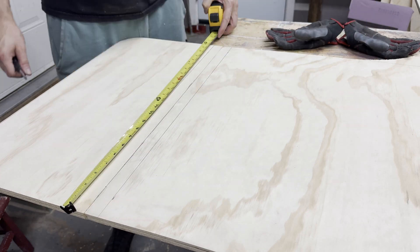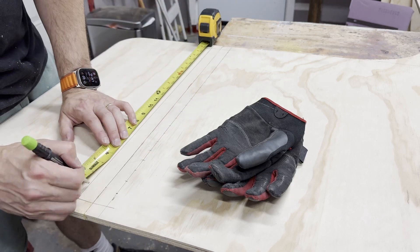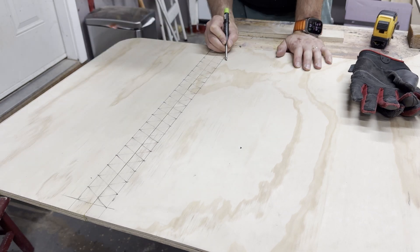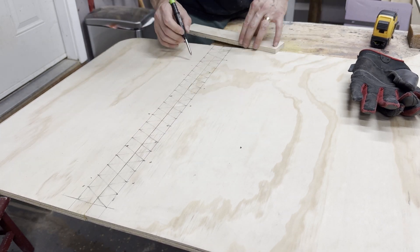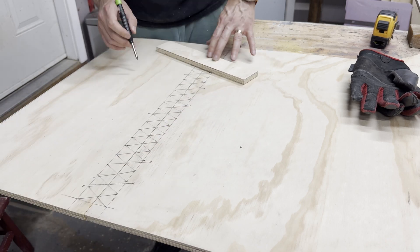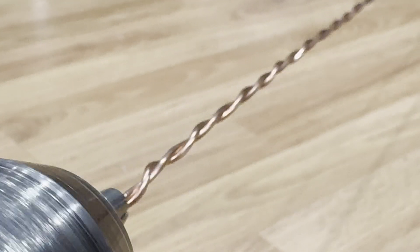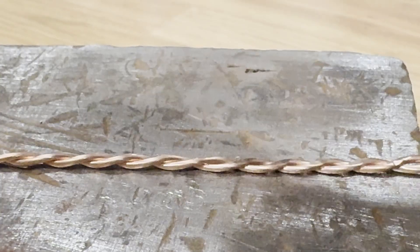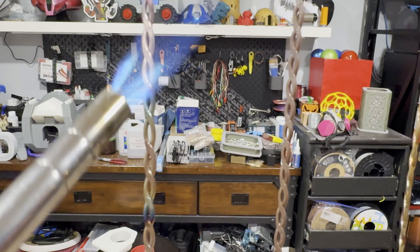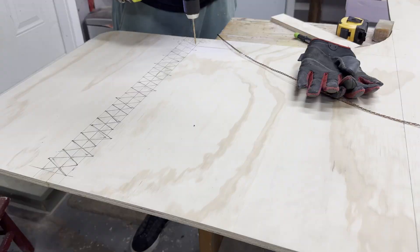For the top surface I didn't want just a straight line where the two pieces of wood joined, so I thought I'd try something new and inlay some metal wire lacing to hold the two pieces together along with some resin to hide the joint. I laid out the pattern but it seemed too uniform, so I went back and tried to randomize the lacing a bit. In hindsight I think I put too many laces in — it's a little busy, but at least now I know for next time. To prepare the wire I used a drill to twist it together then hammered it flat to create more of a chain look. This hardens the metal and makes it difficult to work with and more prone to break, so you need to temper the metal by heating it up and letting it cool down slowly to make it soft and flexible again.